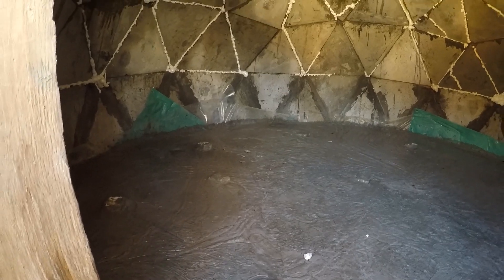Take two on the dome — we did a floor also made out of aircrete. I have about five inches of flooring done here that should give me the same insulation as in the walls. I've filled all the gaps I saw with insulation to prevent heat loss.